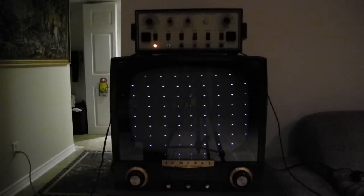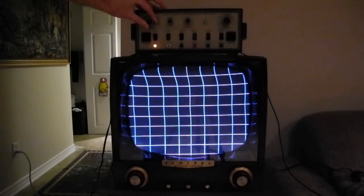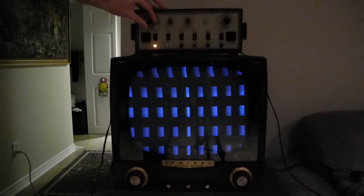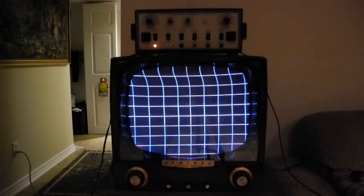To test the RF input, we can use this 1955 Admiral black and white TV, which I covered in another YouTube video. I've set the mode to RF output and connected it to the TV antenna terminals, adjusted it to channel 3. We can see the same patterns, although obviously not the color bars. Because I don't have a CRT color TV, I can't demonstrate using the direct connection of the red, green, and blue grid leads to a picture tube.